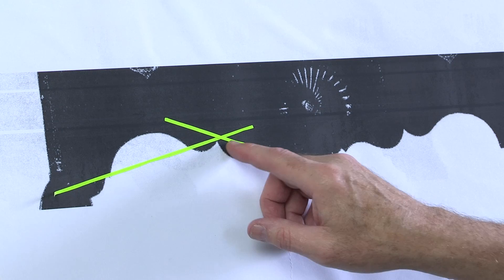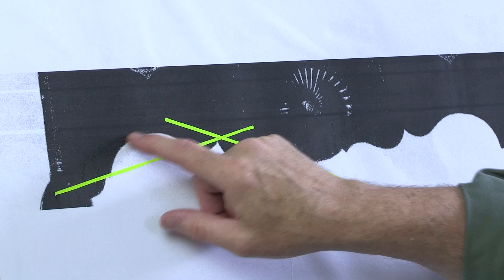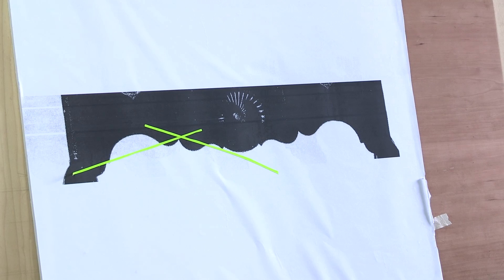I've got a pairing of cyma curves but they're not symmetrical, and there are also a couple layers of difference. The major curve on this large cyma is concave. The major curve on this small cyma is convex. It's almost like they have a major and a minor but flip them opposite each other to create more contrast.